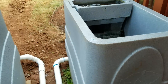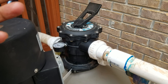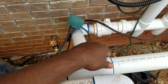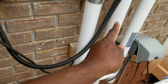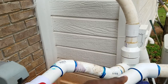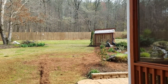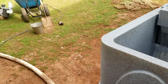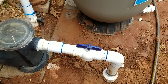So the flow path is: bottom drain and skimmer to the sieves, then to the bead filter. The bead filter can filter down to 12 to 15 microns. After that, the water travels to my UV — 120 watts — but I have it split: 50 percent goes through the UV and 50 percent goes to a line that returns up to the shower in the bamboo house, which I'll explain in a moment.